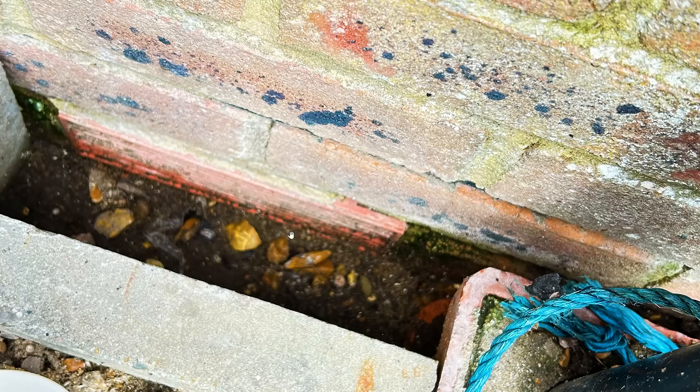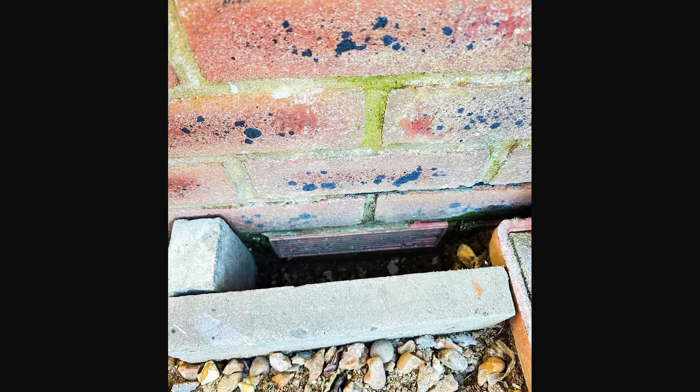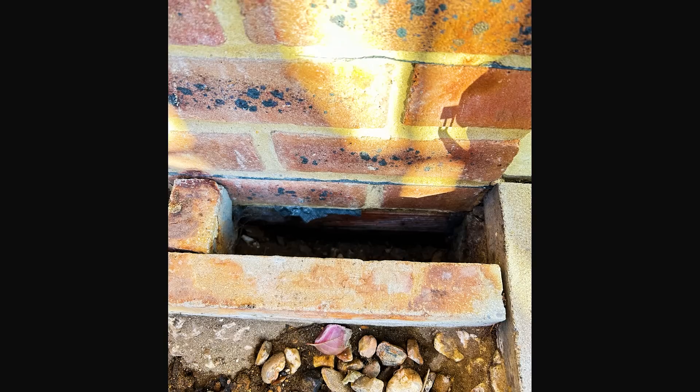You can see that this air brick is very low in the ground, and what's happening is that water is collecting in there and just pouring into the air bricks, obviously ending up under the floor. You can see damp here and the poor condition - that's the damp proof course going above the air brick. Somebody has had a go at pointing in that bit above the air brick. Here's another shot showing a low air brick right beside a rainwater gully, with signs of mold and damp on the wall.